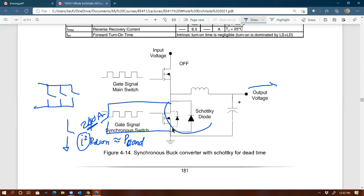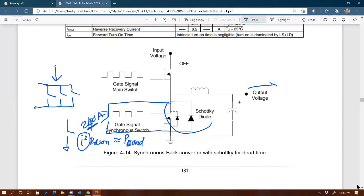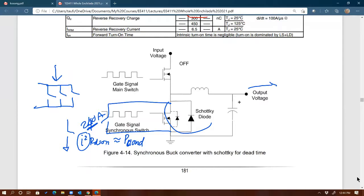So rather than pushing it into just one MOSFET, why not put parallel MOSFETs? This is common, right, in an application that requires very large current on the output. So that's the upside, that you are improving the efficiency by doing it this way, because by having a parallel path, you are splitting the current. When you're splitting the current, you reduce the losses, so you improve efficiency. Another good thing about paralleling MOSFETs is that MOSFETs have kind of an inherent thermal runaway protection.